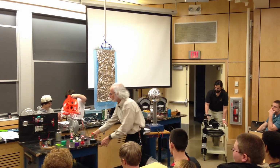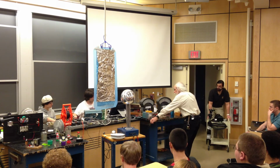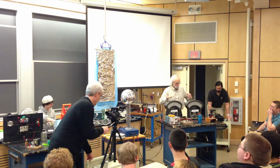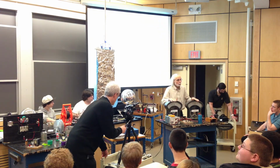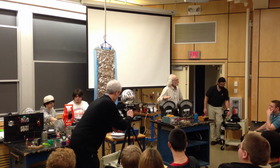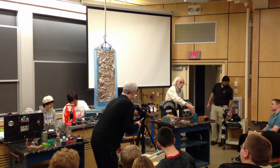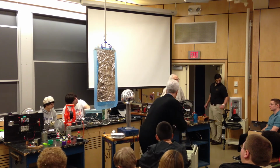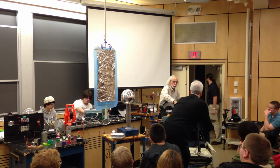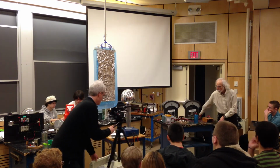So what we would like to do is investigate that charging rate a little bit more in a more focused manner. And so once again, welcome to the world of ancient history at an Ivy League school. I'll bet you don't have meters like this. These are two big old demonstration meters. Now we've got a big capacitor here. This is just 2 layers of aluminum foil rolled up with saran wrap between them. It stores a fair amount of electricity. We've got this set up in a very similar fashion. I can charge this and I can discharge it. Let's have a look at how that goes.